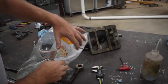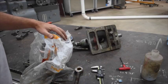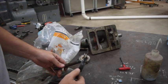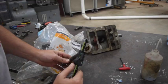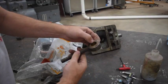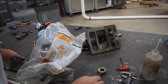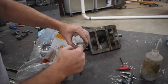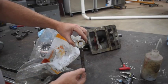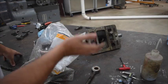We're on part three here and I'm going to be remaking this part right here. This is a 5/8 coarse thread on this and the inside diameter of this hole is .865". You can see there's a bushing pressed in there, so we're going to press that out and then get the diameter of the actual hole. It looks like this is off-center from the shaft itself, and I'm guessing that works along with the cam to create extra leverage and movement and locking motion.